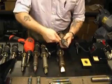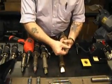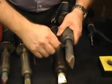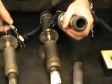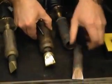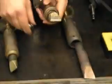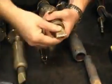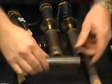And so what you have to do is periodically maintain these irons. We've got irons in different modes of cleanliness. This particular iron hasn't been well kept at all. You can see there's quite a bit of buildup on there. Now that's going to be a little bit harder to clean off. If you start right off keeping your irons properly maintained, you're going to find that it's a lot easier to keep them maintained, periodically going in and re-cleaning them.